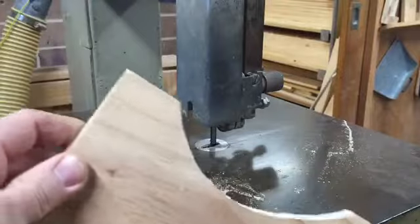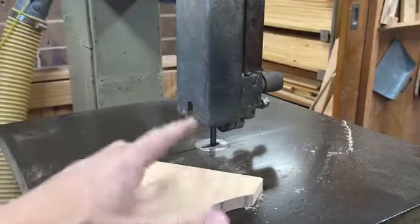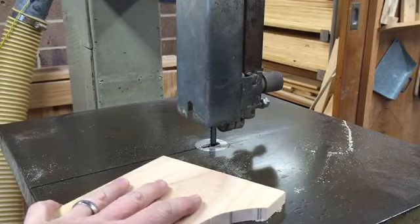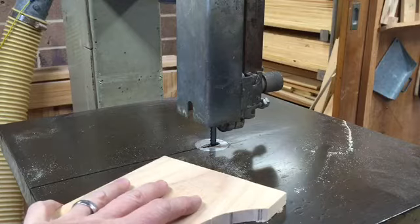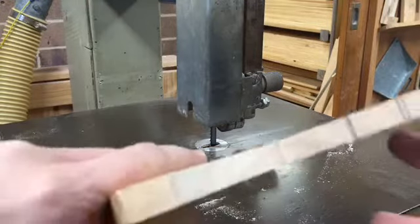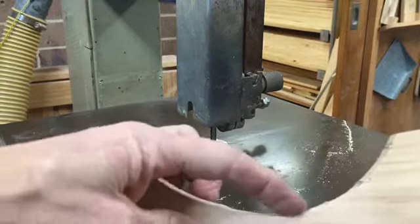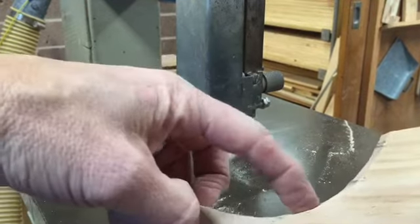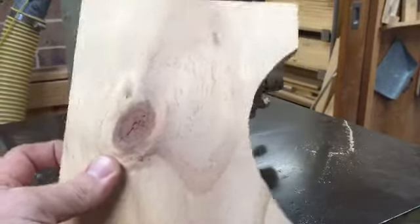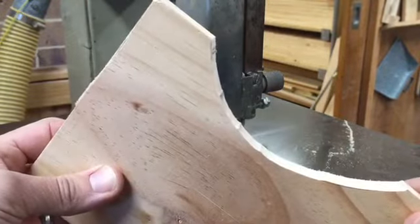While that cut was being made you may have noticed a ticking sound from the blade. That's actually from where the join of the blade is — sometimes when blades are repaired the join can be just slightly thicker or have a tiny bend in it. In this case the blade looks like it does have a bit of a kick in it, making it jump every now and then. This is one reason why the bandsaw isn't really good for very accurate cuts unless you've got a really nice blade that's been set up very well.